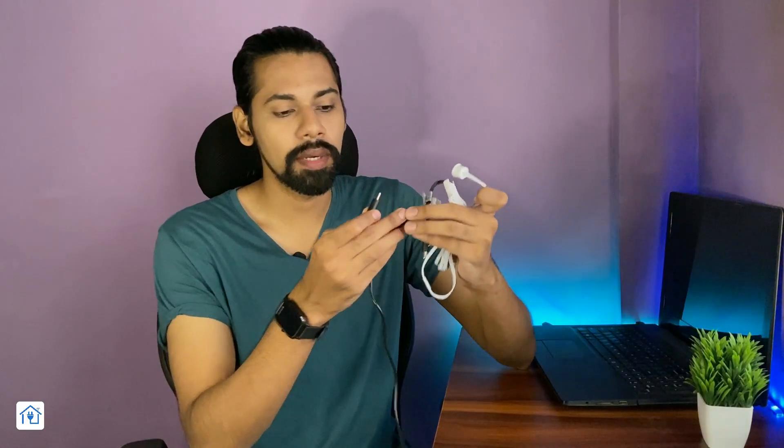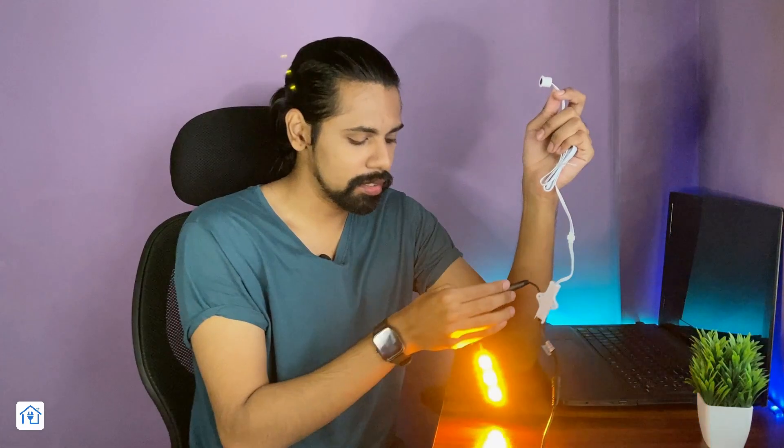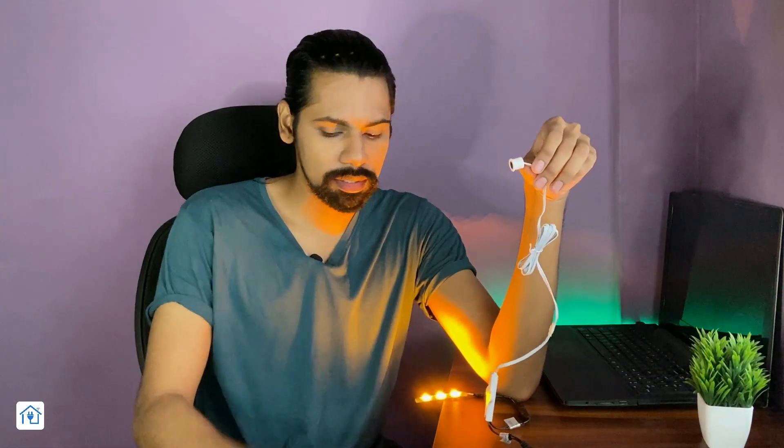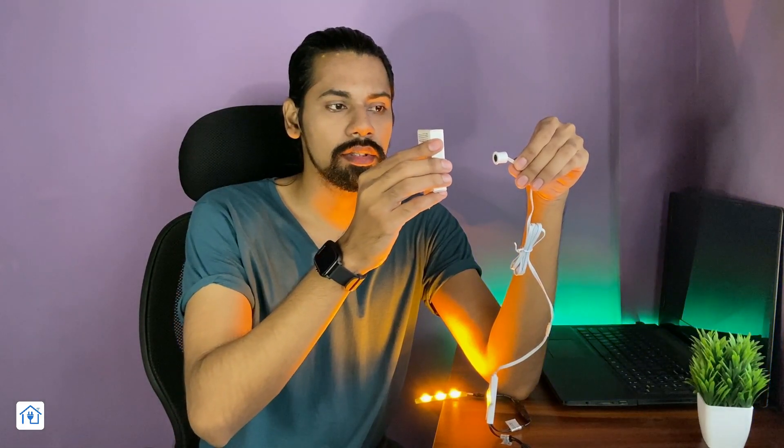This is our 12V power adapter and this is our LED strip. The LED is on because there is no obstacle in front of the sensor. When you block it, it turns off, and when you remove the obstacle, it turns on again. You should use the silver tape for better sensing range. On a black surface, the sensing distance is very low — almost 10cm. On a white surface, the sensing distance increases a little. It is sufficient for cabinets, wardrobes, and cupboards.